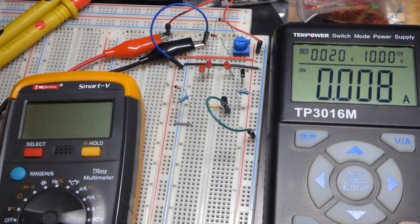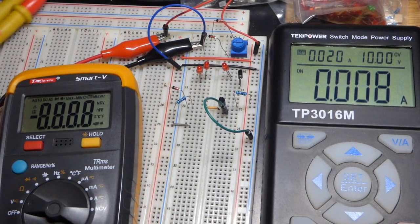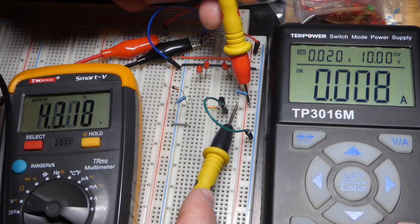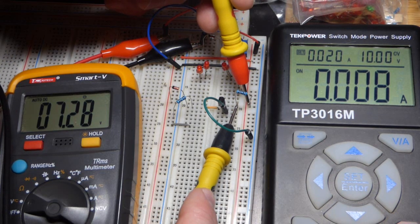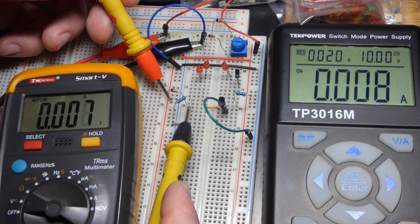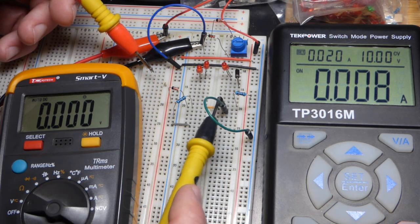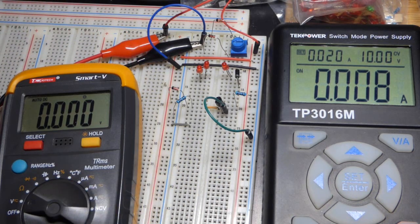So that's the entire circuit, not just the load. First we're going to set the meter to measure voltage and look at the voltage across the resistor. As I said, it's the voltage across this resistor and its resistance that sets the current. You can see about 7.3 volts right there. Across this Zener diode we have about 8 volts going to the base of the transistor, and then to the emitter — we're losing about 0.7 volts there.